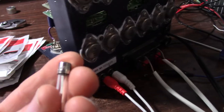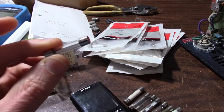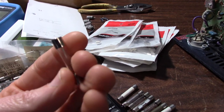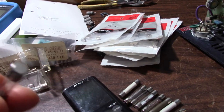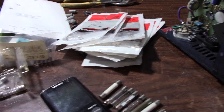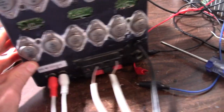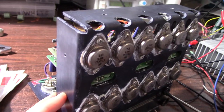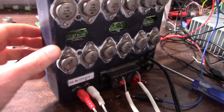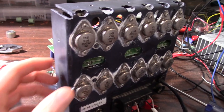I'm checking the fuse in this thing — it's a 32-volt 15-amp fuse. Same thing in the other amp. Did that come out of the factory like that? I downloaded the service manual and it says somewhere that it uses a 15-amp fuse, and the service manual says it can draw 14 amps. That's hard to believe. Even at say 600 watts in bridge mode, if you factor in the efficiency of a class AB amp it might hit close to a thousand watts — but only temporarily, short term — that little power transformer would smoke if sustained too long.